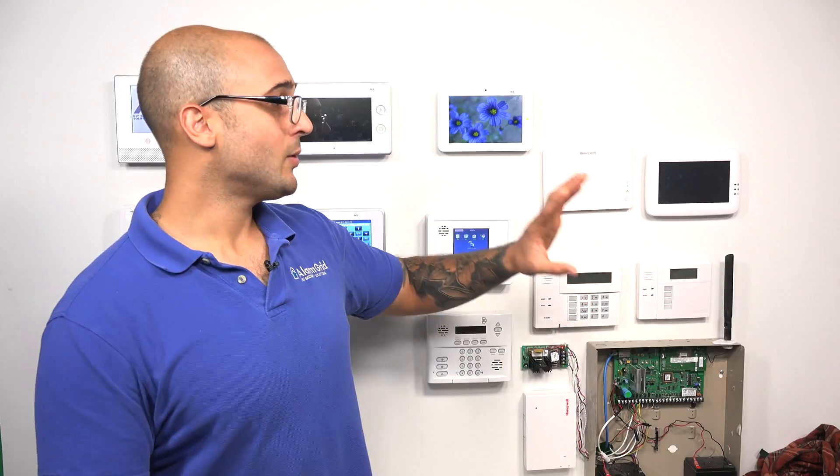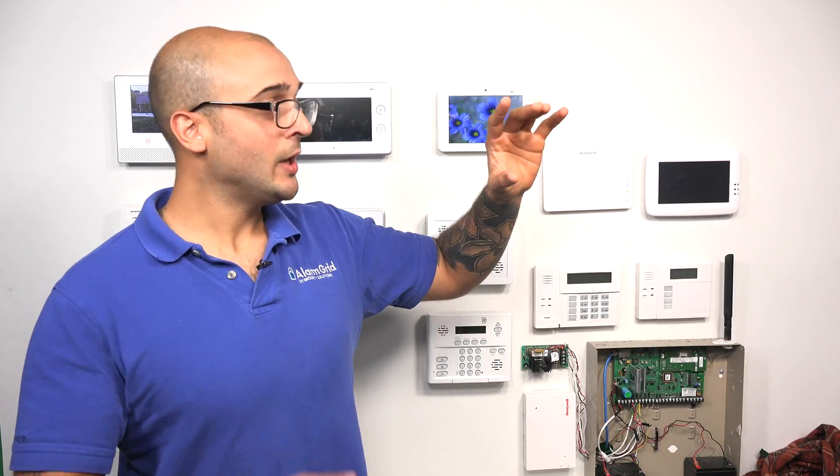Now with crash and smash, even though it still has the burg dialer delay, Alarm.com is still going to look for that disarmed signal to come from the panel, and it's still going to send that signal over to central station, and central will still be able to respond to the signal as if it's a burglary alarm. So even with the burg dialer delay enabled, if the system is triggered during that time, Alarm.com is going to get that signal and pass it to the central station to respond to it.